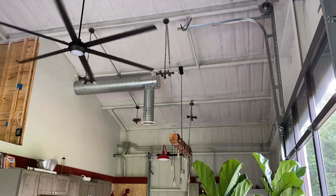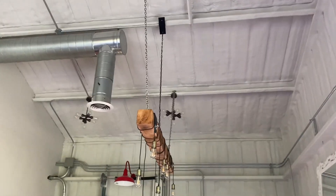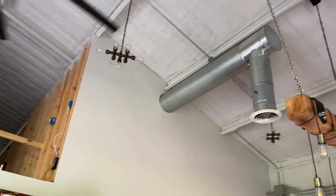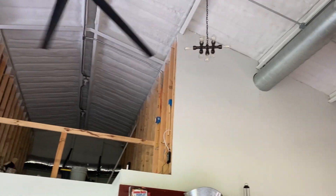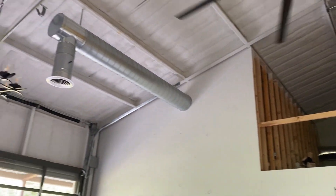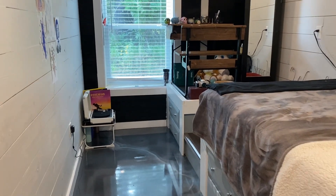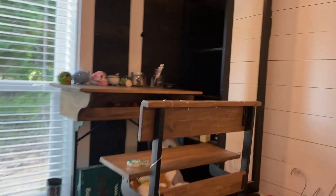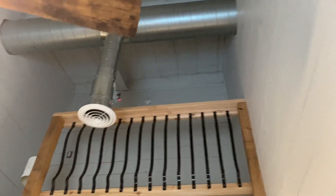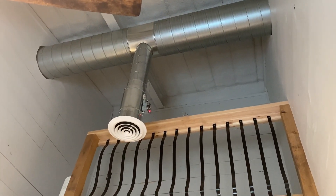The two different ducts that come out into the living room area - I think it's a 14-inch tube - basically form a horseshoe that runs down into the two bedrooms. Across the top they actually used a soft flex tube where it'll be hidden, then back into the master bedroom and back out this way. This is one of the kids' rooms, and in the horseshoe of the ductwork it just passes through the rooms with a drop-in there.